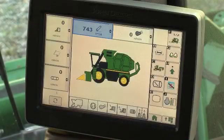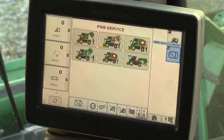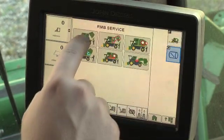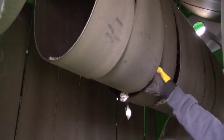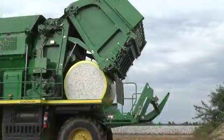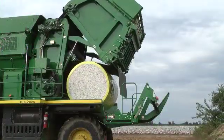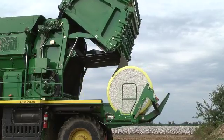Press the round module builder or RMB service mode button to display the RMB service mode screen. RMB service functions are available to allow operators to inspect and service RMB components. Operators can also perform manual control functions using the power module tether that otherwise would be executed only in sequence by the RMB controller.